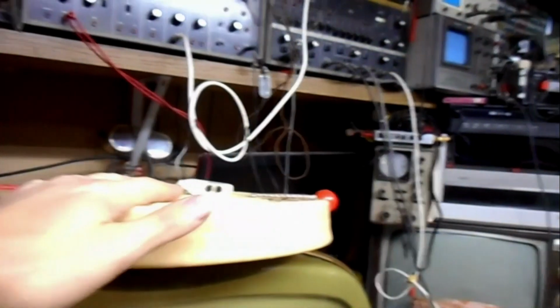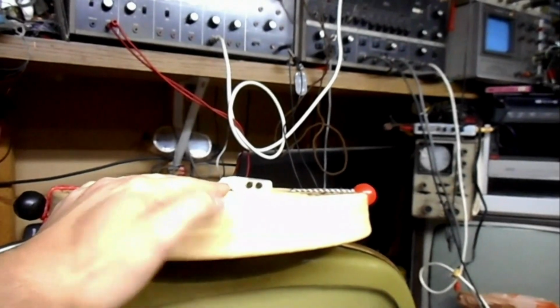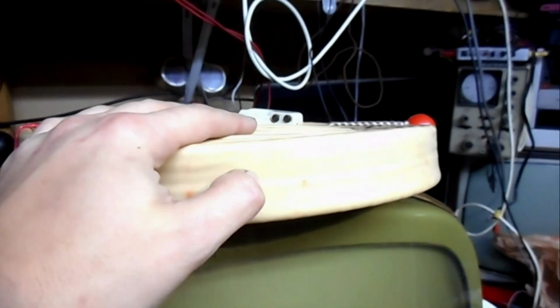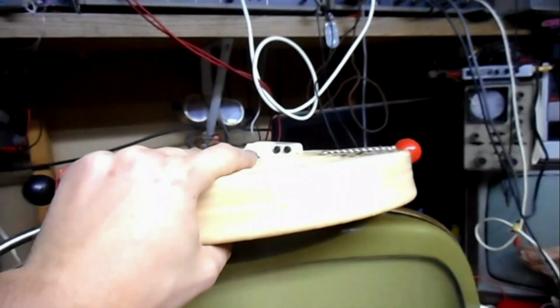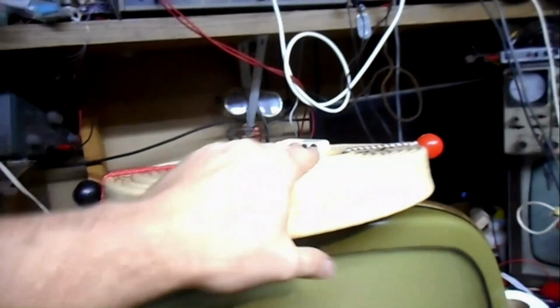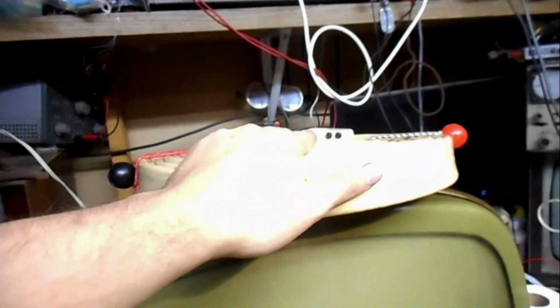Yeah, there's 15,000 volts traveling down the main cable, but it's traveling inside of a coax with a grounded shield. So if one cuts through this cable into the high voltage cable, it's more likely that the high voltage will arc out to the shield of the coax that's grounded from the center conductor that's inside the grounded conductor than it is for you to get direct connection to the electrical. Same with the horizontal circuit. That also has pretty good shielding. So really, as long as you don't cut deep enough that you start getting the colored insulation of the inner conductors, the original cables are fine with light surface damage, or even moderate surface damage, really. Just as long as it doesn't get through the outer protective surface of the cable.